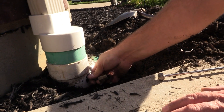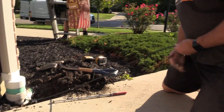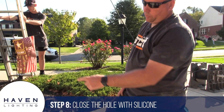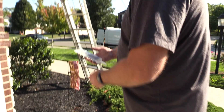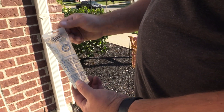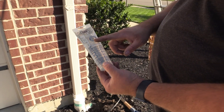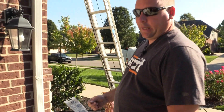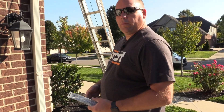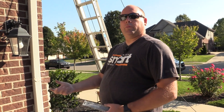I pull on the wire and it's out. Now what we do is silicone this hole up. The caulk I like to use is ultra clear, made by DAP — you buy it at Home Depot. It's really nice because you can apply it wet, when it's cold, or when it's hot. It doesn't fully harden so it stays a little bit gooey, which is nice if you ever have to redo something — it's easy to take off and redo.